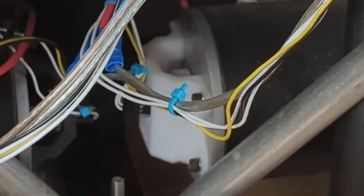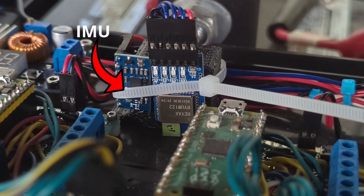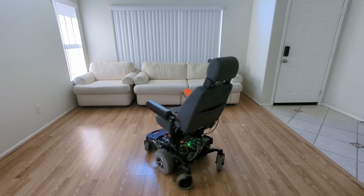The system starts with wheel odometry and the gyroscopes. It uses sensors on the wheels to measure how much they've spun, and from that I can compute how far forward or backwards we've gone. The gyroscope on the vehicle measures how much it's turned left or right. I use that data a hundred times a second on the predict step of the Kalman filter — every hundredth of a second I take the current pose estimate and add how far forward we've gone and how much we've turned.